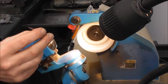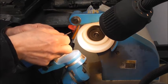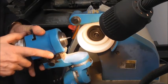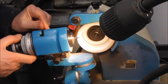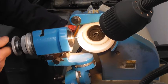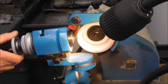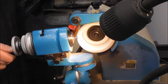Let's grind the stylus stem spigot diameter. We have the blank cut to length and put it in the collet - it's a 3.17, set about the right amount of projection. We want the absolute minimum for rigidity. Set our rotary on zero, set our depth cut to about 5mm, come in until the wheel contacts on that 3.17 diameter. Once we contact, we know we're at 3.17 - taking note of the dial, we know we want to come down to about 2.22. So let's take off about 0.4 on the radius; that'll be slightly up on the finished size.